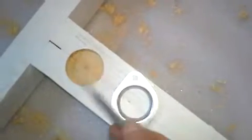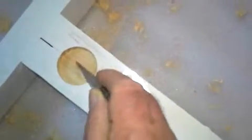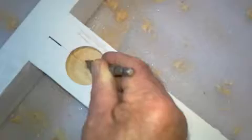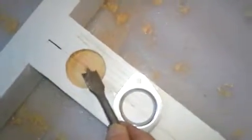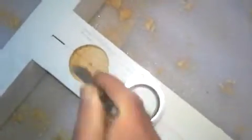Now, once both sides are done like this, you want to drill a 3/4 inch hole using one of these all the way through. But I suggest you do half on one side, half on the other, so that you come up pretty close without drilling on an angle. Now once you do that, the wheel shaft axle will have a lot of play in it, in here. That gives us enough adjustment to move the wheel around to put it where we're going to put these other outer holes in to hold the bearings down.